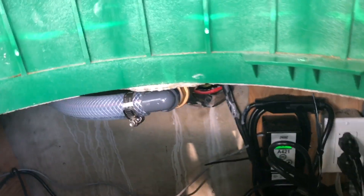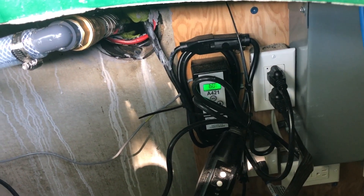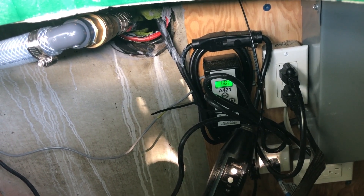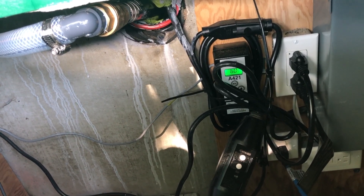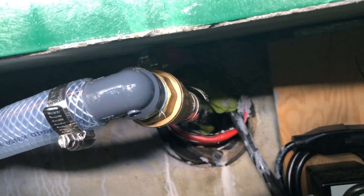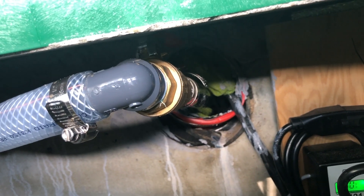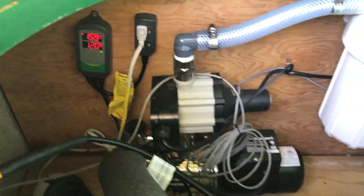The whole pump chamber is insulated with about R10 insulation and it's underground — it keeps its temperature pretty well even without the heater. Then we've got a thermostat on the heat trace as well, set for kind of the same condition so that the water in the water line won't freeze, and then it's insulated out into the lake. We have our on/off valve for this pipe. The whole water line is in a Big O — that's that red stuff, like a weeping tile type material. Then we've got our 5-micron filter here, a coarse filter that comes out of the pump.